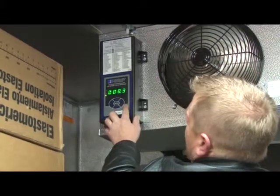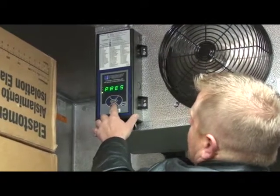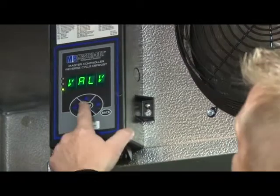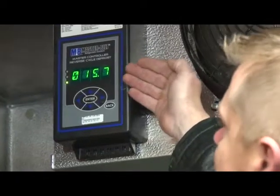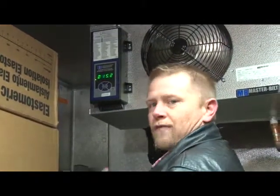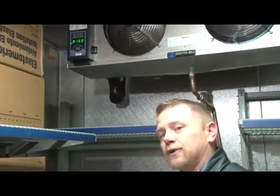Now we want to double check our valve position. Press the back button — SUPH is displayed again. Press the down button repeatedly until you see BALB. At that point, press enter. You can see the percentage of our valve opening is 15 to 16 percent. That is right in range of a completely fully charged system — you want to see it between 10 and 25 percent open. It has a 1596-step electronic expansion valve, so when it's 10 percent open, it's open roughly 160 steps.